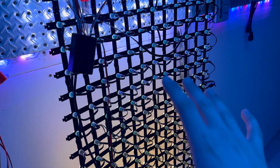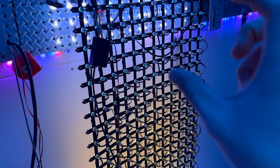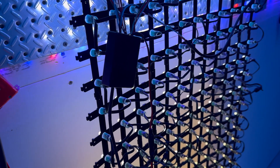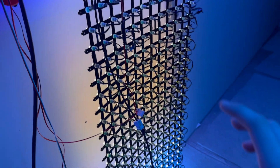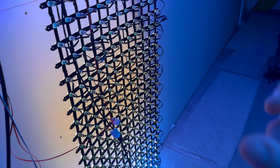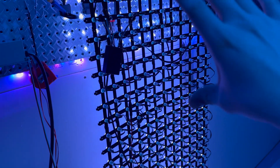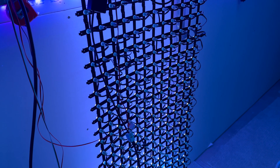I actually have an identical wall set up somewhere else where I'm injecting every single strip with extra power. It does make the LED wall look a lot better — it dims better and is less glitchy. As you can see, if I dim this effect down, it does look better because the LEDs up top are drawing less power, making more power available to the ones lower down.